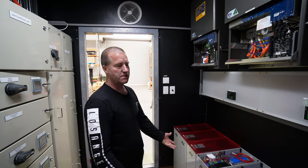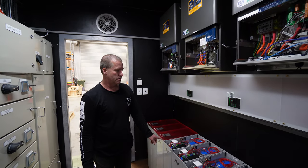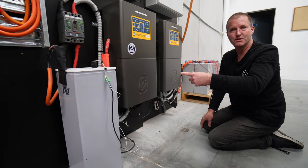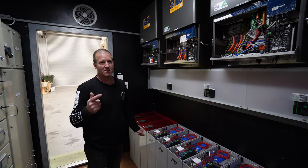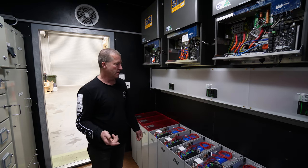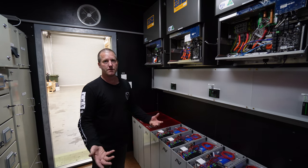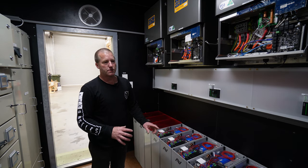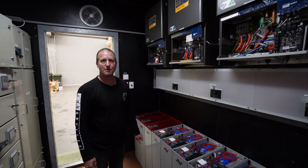The batteries are safe up to 60 degrees Celsius, and we've been testing a module, which I'll show you later on, actually, if you've got time, which has been cycling almost 6,000 times now. We've cycled it, charged it, discharged it, charged it, discharged it every hour for 15, 16 months. And we ran it at 44 degrees Celsius for 12 months to prove that the temperature didn't affect the module. And so far, the battery has gone up by 1% in capacity, which is quite unusual for a battery to go up in capacity.